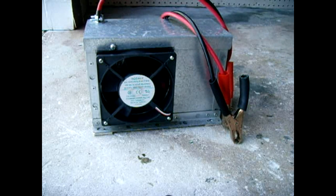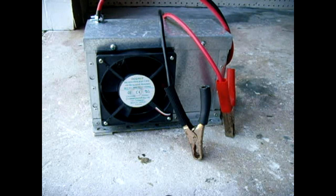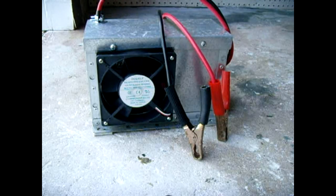I installed a fixed resistor — the value is roughly 0.1 ohm at around 30 watts — in series with the positive going to the center tap of the transformer. The resistance is so low that once you make that connection the current just flies into the circuit. By using the 0.1 ohm resistor in series with the positive going to the center tap, you effectively eliminate that large inrush current that would go into the MOSFETs.